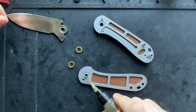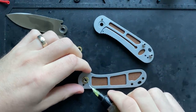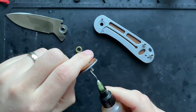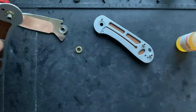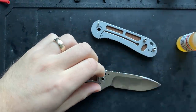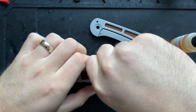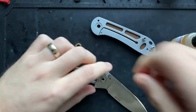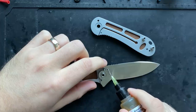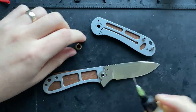A little drip right there — problem solved, case closed. That was maybe a little too much. I'll go ahead and transfer over the stop pin just for my sanity, since I'm putting things back together from this side so everything's in position. Then a drip of oil right into the detent ball hole to lubricate the detent ball path.